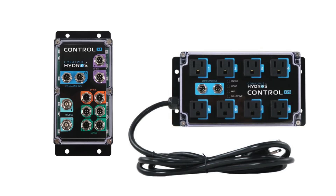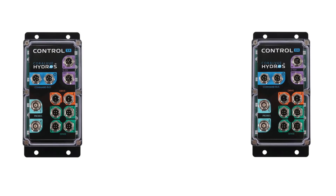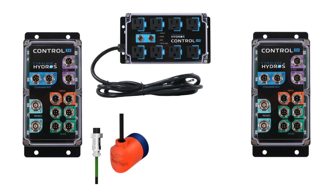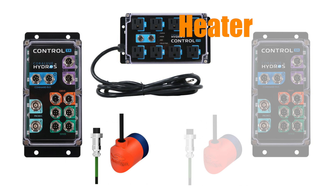On your collective, you have a Control4 and an XP8. If the Control4 were to fail, the XP8 will pick up the slack and still allow you to access your system. In the Hydros world, the more devices you have, the more redundancy you have. If you have two Hydros Fours and an XP8, I highly recommend putting one temperature sensor on one Control4, the other temperature sensor on the other Control4, and the heater on the XP8. If one Control4 fails, the Hydros brain will automatically switch over to the other temperature sensor on the working brain and your tank would be completely safe.